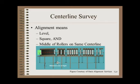If you had a guide in the machine, you might find that it continually runs off center to keep the web centered. This construction mistake is extremely serious, because once wiring and piping are connected, it is next to impossible to move a module to the front or back, even if you could extend the base plate mountings far enough.